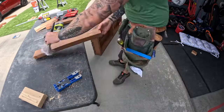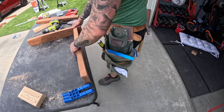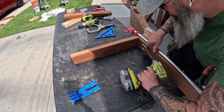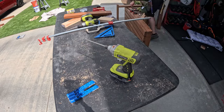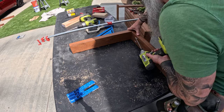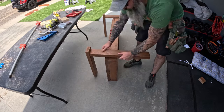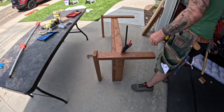Next up will be our front legs and arm rests. The front legs are the two 24-inch pieces and the arm rests are the two 22 and a half inch pieces. Drill pocket holes into one side of the legs and attach them so the arm has an overhang of one and a half inches. Remember we sanded the front of the arm rest where the hand will be, so make sure that part ends up facing forward. The pocket holes in the legs should face towards the back of the bench so they won't be visible from the front. After connecting these, install them to the seat frame — from the bottom of the leg to the bottom of the seat is 13 inches. Make sure this is squared before you install a couple screws through the front of the leg to attach it to the seat frame.